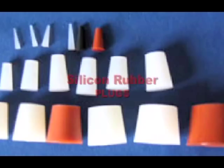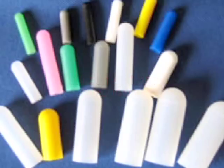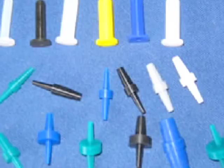Anodizing, like electroplating, adds dimension to the part. But unlike plating, an anodized film grows over all areas exposed to the liquid. This means it is especially important to block off any areas that have critical dimensions. Threaded holes can be especially bothersome. A thread with an additional 1/1000th of an inch added to it will not accept the bolt. Plugs are a great way to solve this problem, and they come in a huge variety of shapes and sizes.